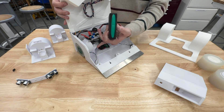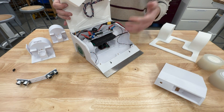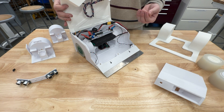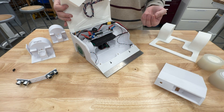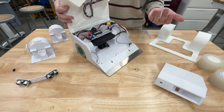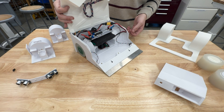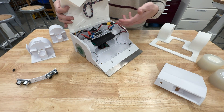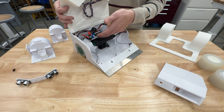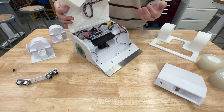We have these little shelves that support the battery directly above the wheel wells, which is incredibly important for increasing traction. We get traction through our friction coefficient and through our normal weight, and by placing this significant weight — the battery — above the wheel wells, we increase our traction grip, which gives us that really strong pushing force. We also have a kill switch that directly interrupts the power going from the battery into the board so that we can easily shut off the entire robot.